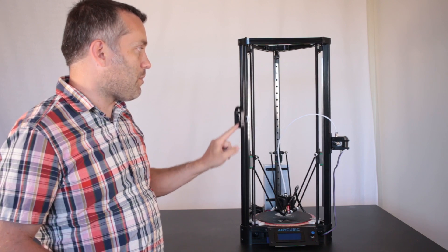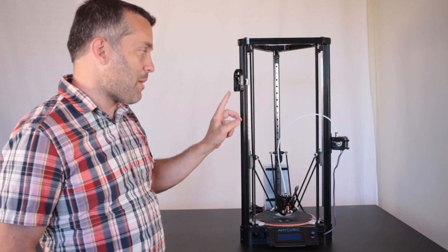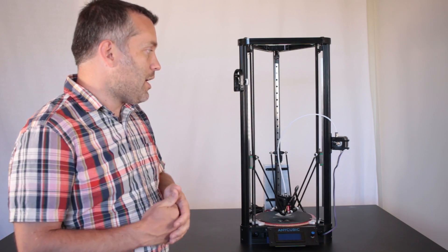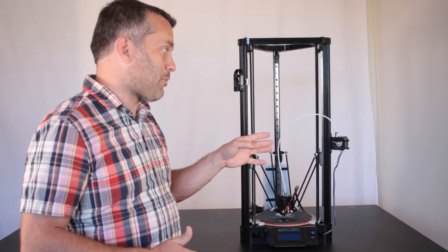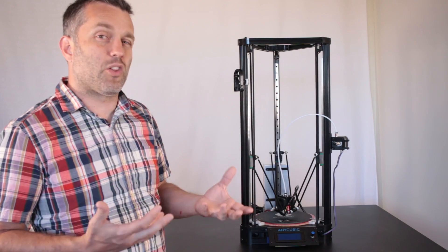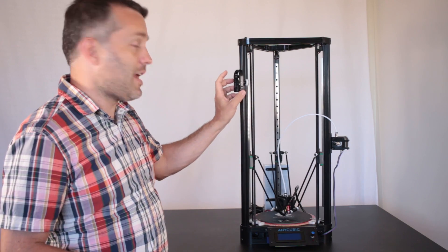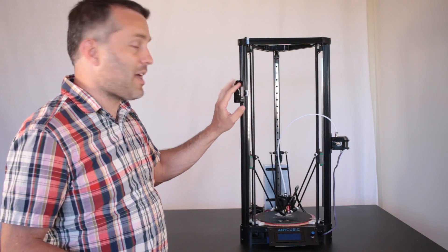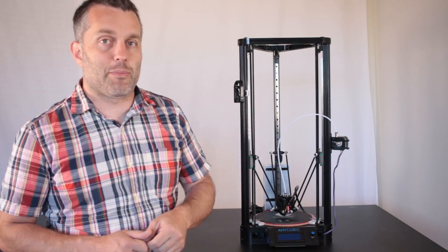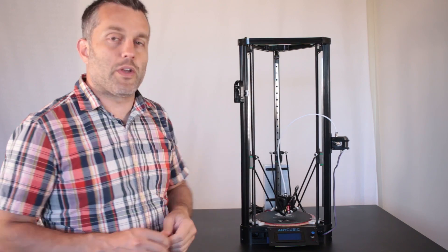These original pulley carriages are actually quieter in motion, so my printer is a little bit louder now. So why would you do the upgrade? Well, the only reason is if you want to put the whole printable area into an enclosure and that enclosure can get pretty hot. I was worried — and still am — about these plastic parts getting too soft and failing in the heat. So that is why I did the upgrade, but unless you plan to fully enclose your printer, don't waste your money. Save your $75.